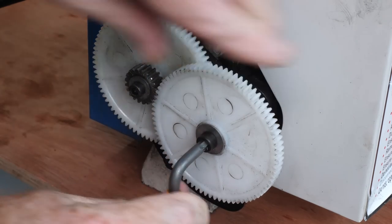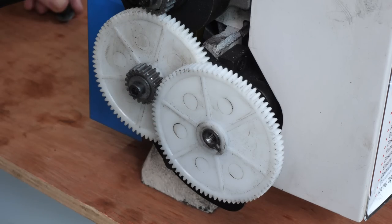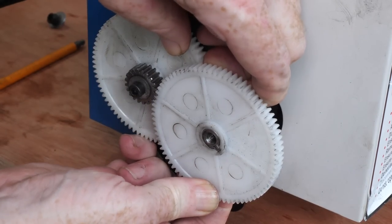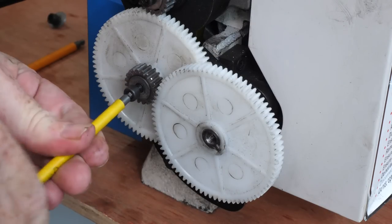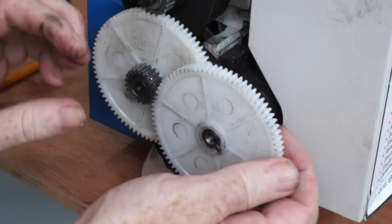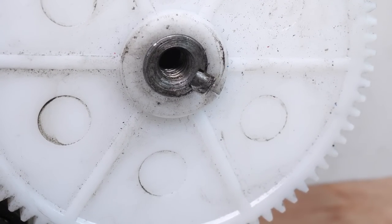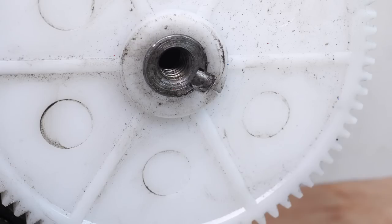To get a better look at this lever I need to disassemble the gear train, so I'm going to start with the larger gears at the bottom. The screws are easy enough to remove, but the gears themselves are very firmly in place. As they're made of plastic I'm very cautious about using too much force to remove them. Looking more closely at the lead screw gear, the plastic is cracked at the keyway — it looks as though they weren't fitted correctly. Removing them is almost certain to damage them further, so I'll need to buy replacements. I know that metal replacement sets are available, so I'll be on the lookout for one of those.